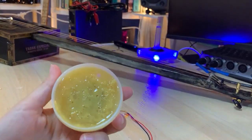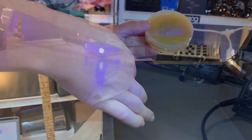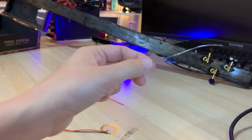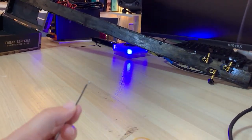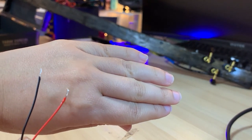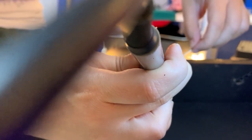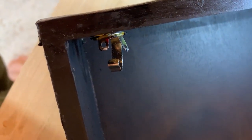I dipped the piezo leads into the flux, then I used my fingers to rub the flux onto the output jack's conductors. Then it's time to tin — or apply the solder to — the tips of my piezo leads, which already came stripped from the factory. I applied a bead of solder onto my iron and then painted the solder onto the tips of my piezo leads. You'll notice that the tips of my piezo leads now have a bright silvery surface. Now I have to tin the tips of my output jack conductors. I started with the ground conductor by heating it with my iron for a few seconds, then brought some solder down onto my iron and ground conductor. I did the same with the signal conductor. You'll notice that the tips of my output jack conductors now have a bright silvery bead on them.